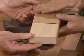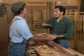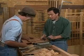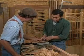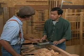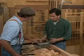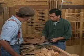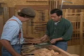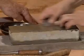That doesn't touch. And now the hollow here just makes it very easy to make it hit in a coplanar manner on two surfaces. Converging, and that's the cutting converging edge. Converging, and ideally it's infinitely small and very smooth. But to create an edge here that's really, really smooth so that you don't get marks from that jaggedness in your finish, you need to go to progressively finer stones. And my final stone is this Honyama stone. It's from one quarry in Kyoto. And it's a water stone, so it's used wet. And at the very, very end, I'll be just very lightly working on this stone.